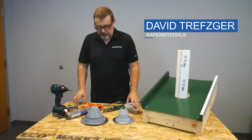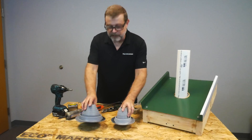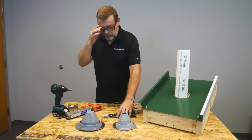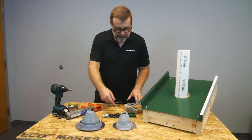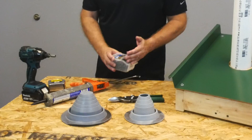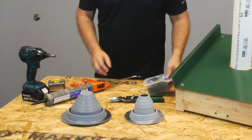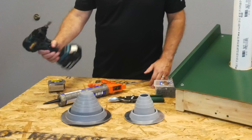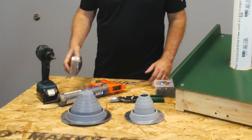The things we need today are pipe boots — we'll talk about what size to use in a minute — a pair of snips, scissors, or a razor knife to cut the pipe to fit, screws (EPDM washer head screws are best for this application), a caulking gun with a urethane roofing sealant, a screw gun with a nut driver, and of course a tape measure to measure our pipe.